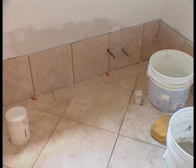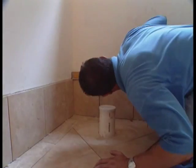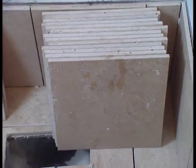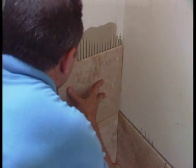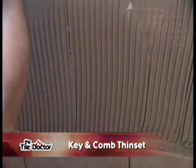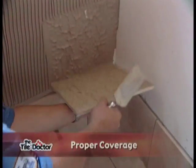We used that level line all the way around to establish a level plane, which meant we had to cut in each piece of tile since we were out of level. We then use our level on top of the first row of tile to make sure it's not only level, but also to check underneath for any tiles that are low or out of place. In this case we're using a running bond — starting with a full tile in one corner going to a half tile on the other side, then the next row starts with a half tile.